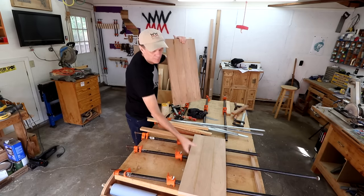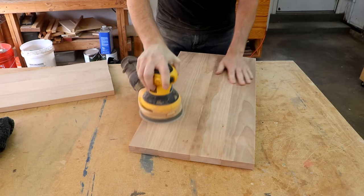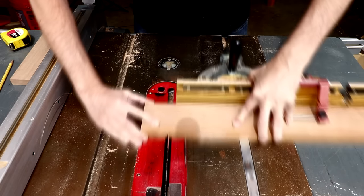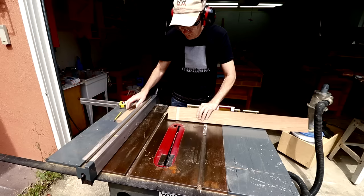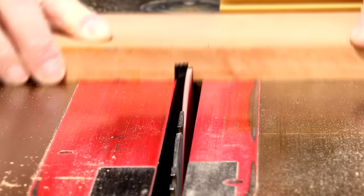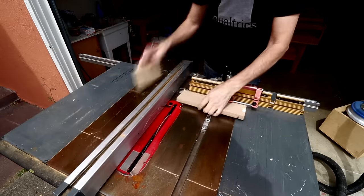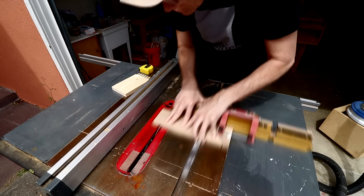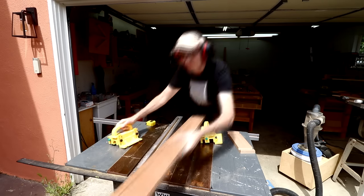There's the top and the lower shelf. I'm going to split this one board into the four legs, but first I need to cut a couple of notches for the dividers. I'm not going to bother installing my dado blades — I'll just make multiple passes with my regular blade. This piece will be the four connectors for the sides, and I'll cut the dadoes the same way.